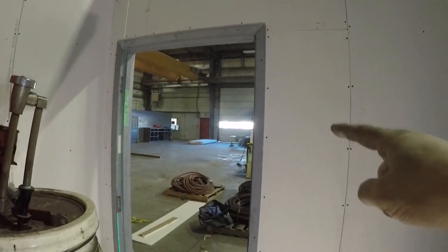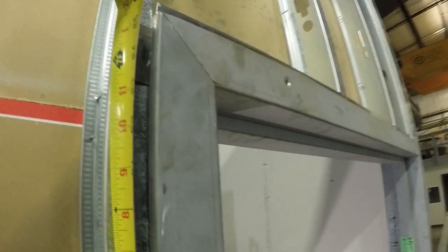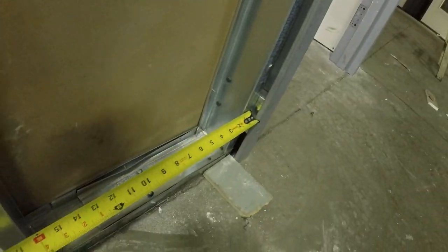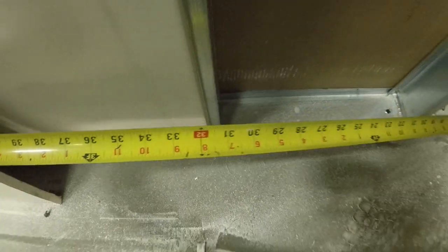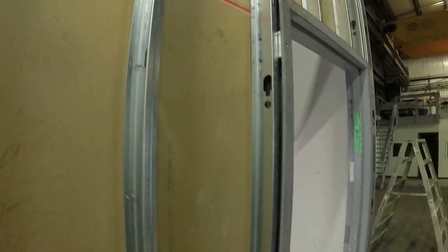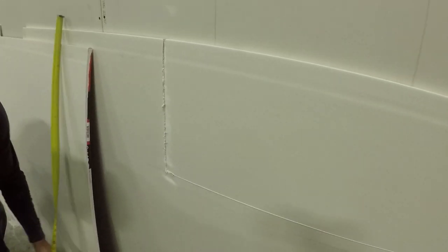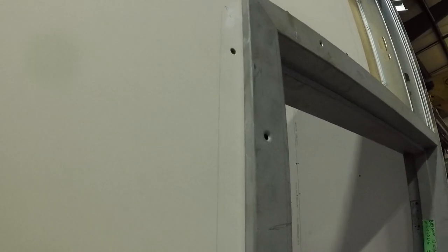There's the order of things from backframing: the top buck, then the end buck, then the two legs. I always put the hinge side leg in first, then the other side. Right here, you measure bottom up and over, and you add a half inch so the board goes inside on the sides. You want to make sure that the board cuts in to the bottom of the casing there, so that it slides inside. You just draw it out on the board, cut it out, and slip it in.